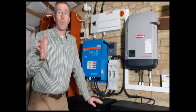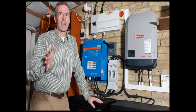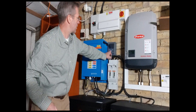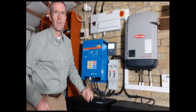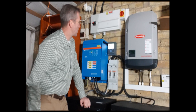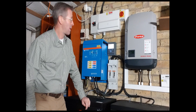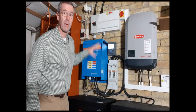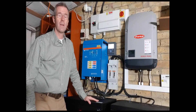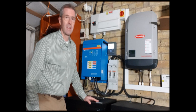I should say today it's middle of winter. It's absolutely pouring down outside so we're not getting a lot of generation going, but we are getting here the colour controller. This is like the nerve centre of the Victron inverter system. It's showing us how much energy we're using, how much is coming from the grid, how much is coming from the battery. In fact, everything here at the moment is coming from the battery. These got charged overnight on Economy 7 and they're supplying the house in its entirety at this moment in time.